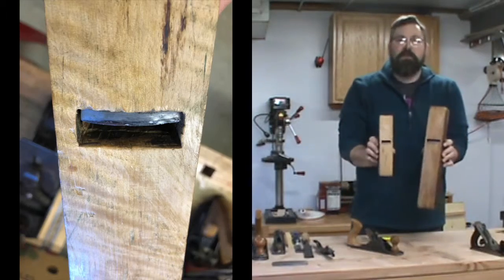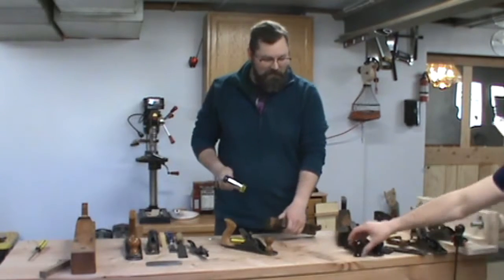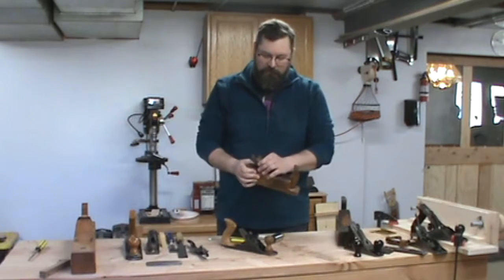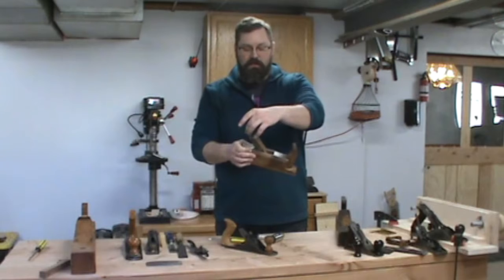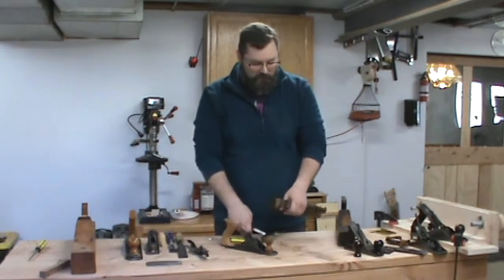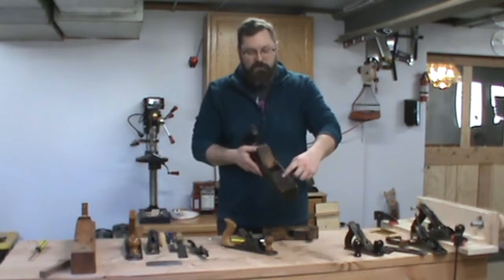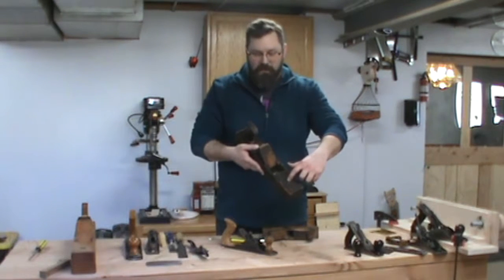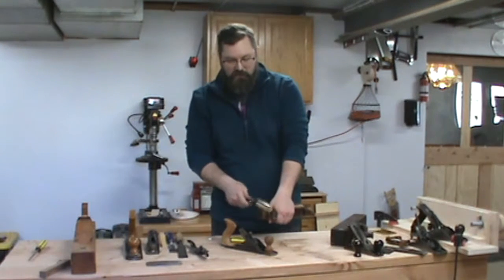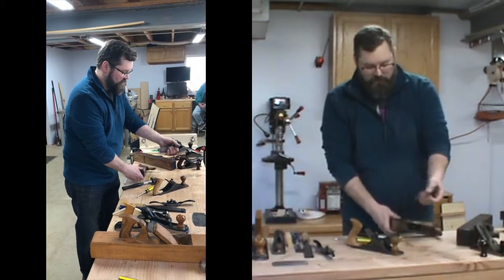The irons on these are cambered, so they are curved irons. For a wooden plane, it's just held in place by friction — a wooden wedge is held in the body and you've got the iron, so there are only three pieces to this plane. To loosen it, you smack it on the heel, or on a bigger plane, you can smack it on the toe on top. This raised piece is called a strike button, and the inertia is what loosens it because the plane body moves while the wedge and the iron stay in place.